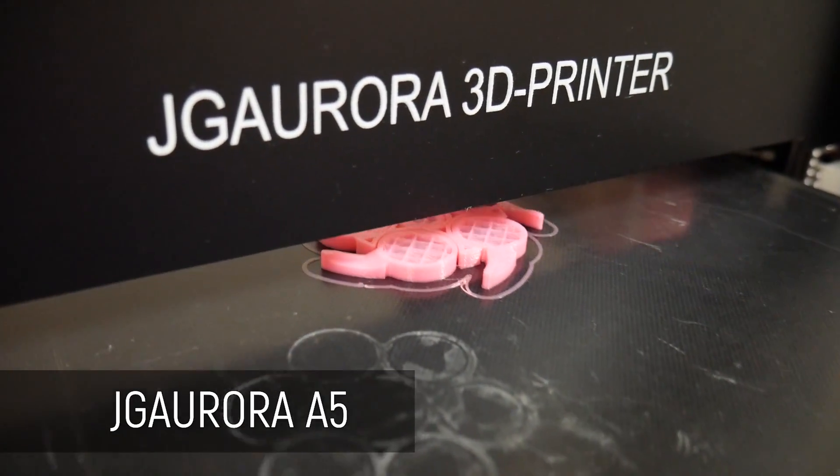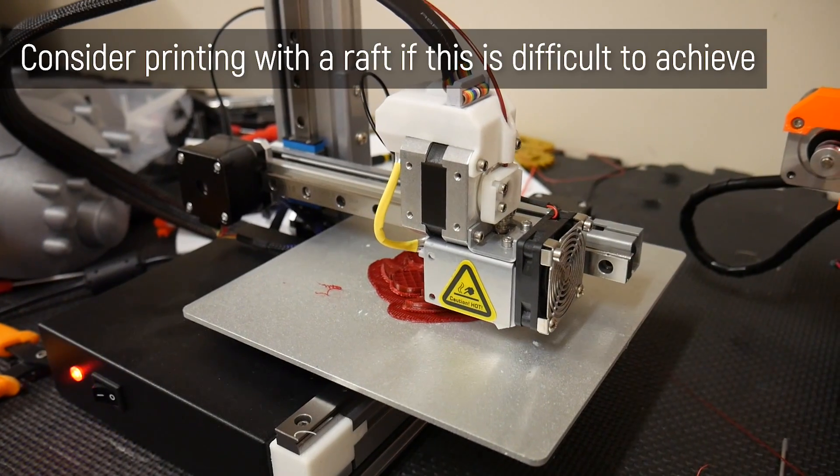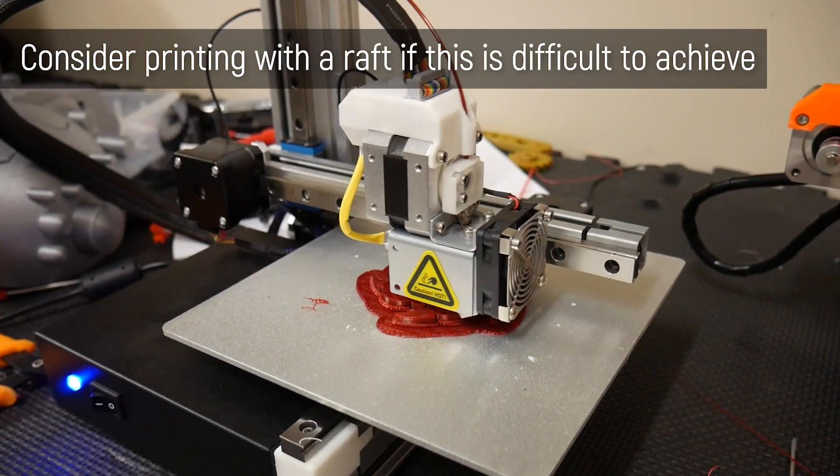The last one to test was the JG Aurora A5 — this one has a bit of under extrusion unfortunately, but it is completely free down to 0.2, and 0.15 is unfortunately not. Let's see if we can free it up — oh, there we go, 0.15 is free as well! Keep in mind your bed level has to be very accurate. Make sure your bed level is as perfect as you can get it before testing this file. There are allowances in the design with a gap that's wider at the bottom, tightening up to the tolerance as it goes up, but if you have too much of what's called an elephant foot your first layers are too close and you will definitely struggle to achieve tolerances.